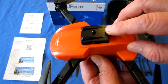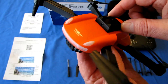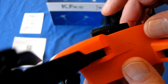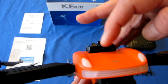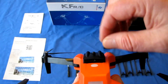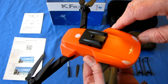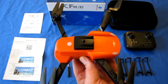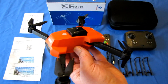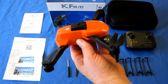One thing special about it: notice this device on the top of the drone — this is the obstacle avoidance system. It has an infrared emitter on top, and detectors on each of the four faces of the rectangle for detecting the emitter's infrared light bouncing off walls or objects. The drone detects that and will try to avoid hitting walls and other objects. This works kind of okay — don't expect it to be perfect, but it should keep you out of trouble for most instances.